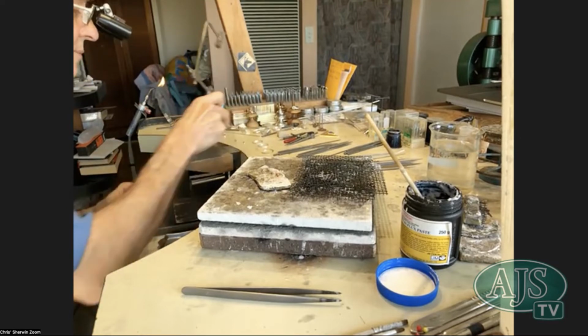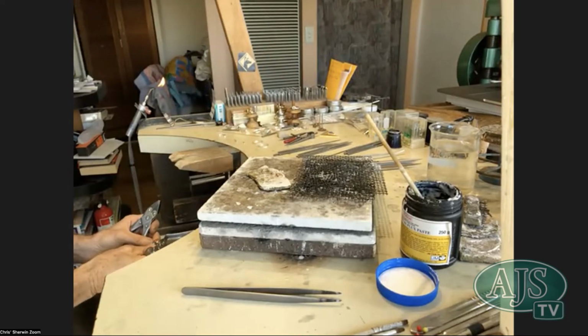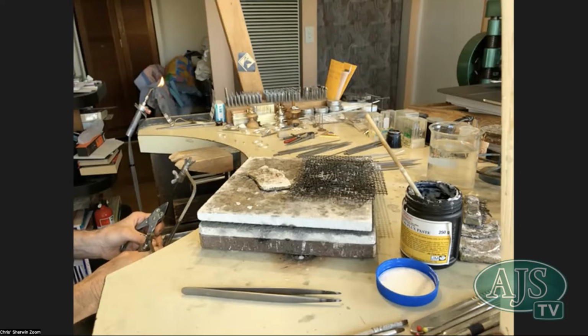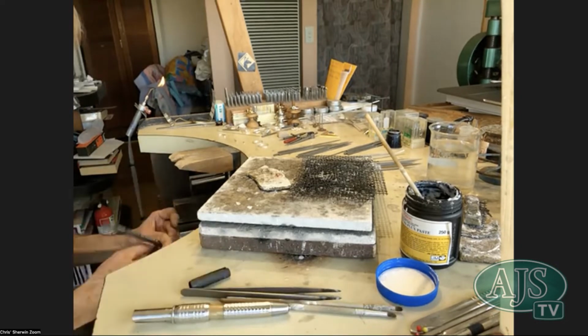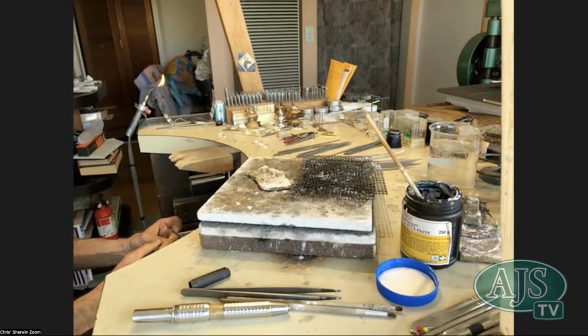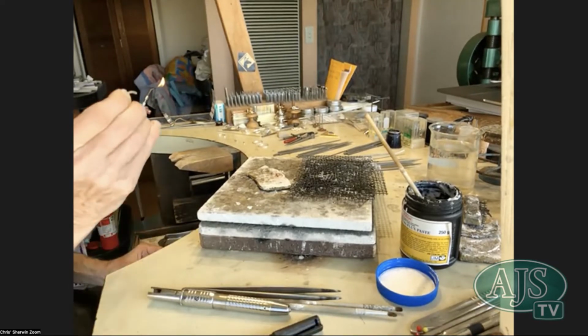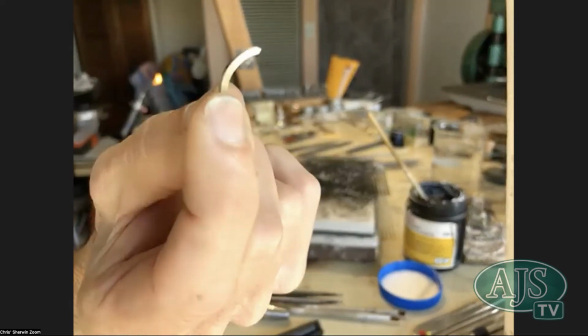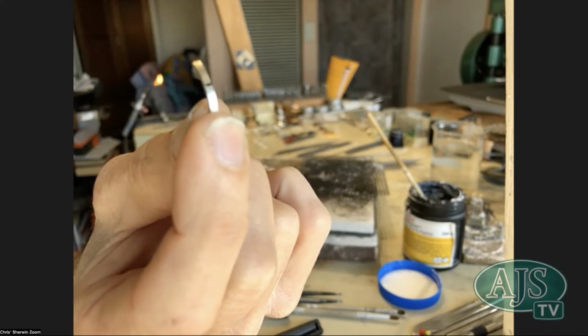That's another sample I've got. I'll use this bit here. I cut exactly the right length. So this piece of metal is actually square wire, slightly larger than the ring that I'm fixing, again, because I want to be able to forge its size. Look for a black pen, there it is. And I'm going to make it so long. I've already got a V on one side of my joint, so I've got a little V shape there, just a little chiseled end, and I've got a little black marker pen mark where I want to chop that off to size.